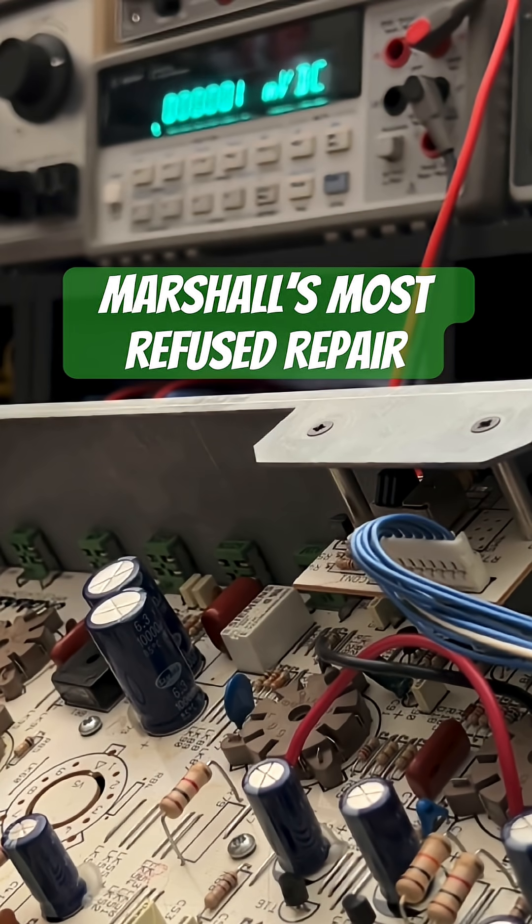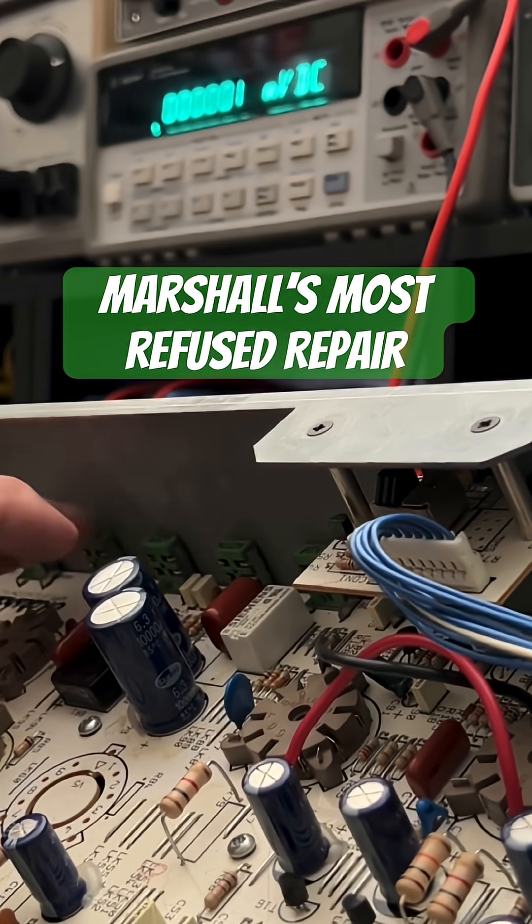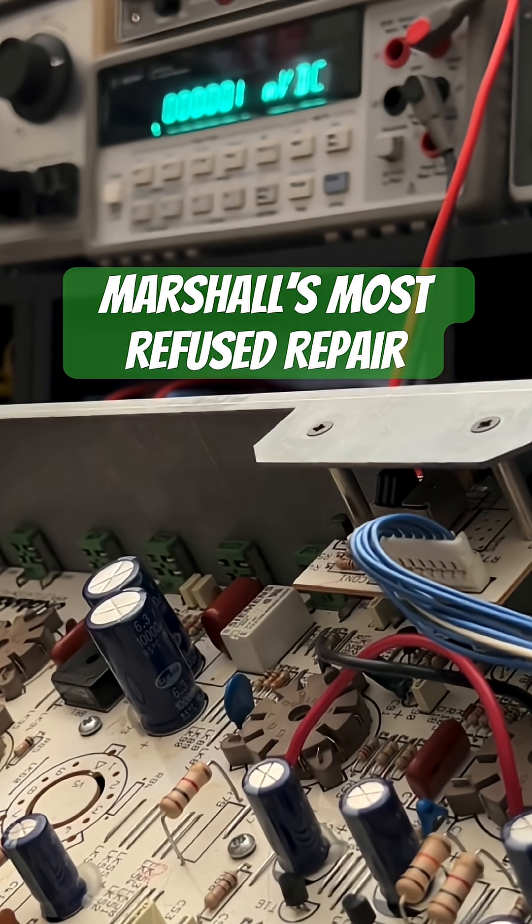So the main problem — this amp is losing signal in a few places. One of the chief complaints is that the mid pot wiper is becoming intermittently disconnected from the conductive strip inside of the potentiometer casing. I've tried to tighten it up, but it's still intermittent contact — it's only making contact at one point. And then you get like a 10 decibel boost in signal when it hits that one spot where the contact patch is buckled upwards.